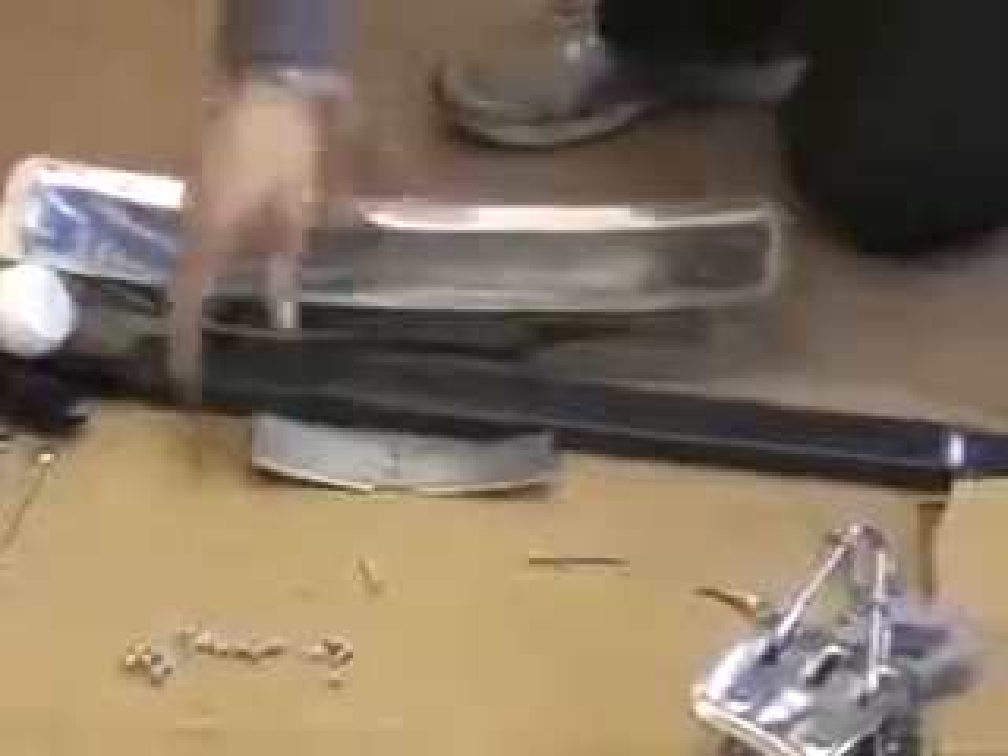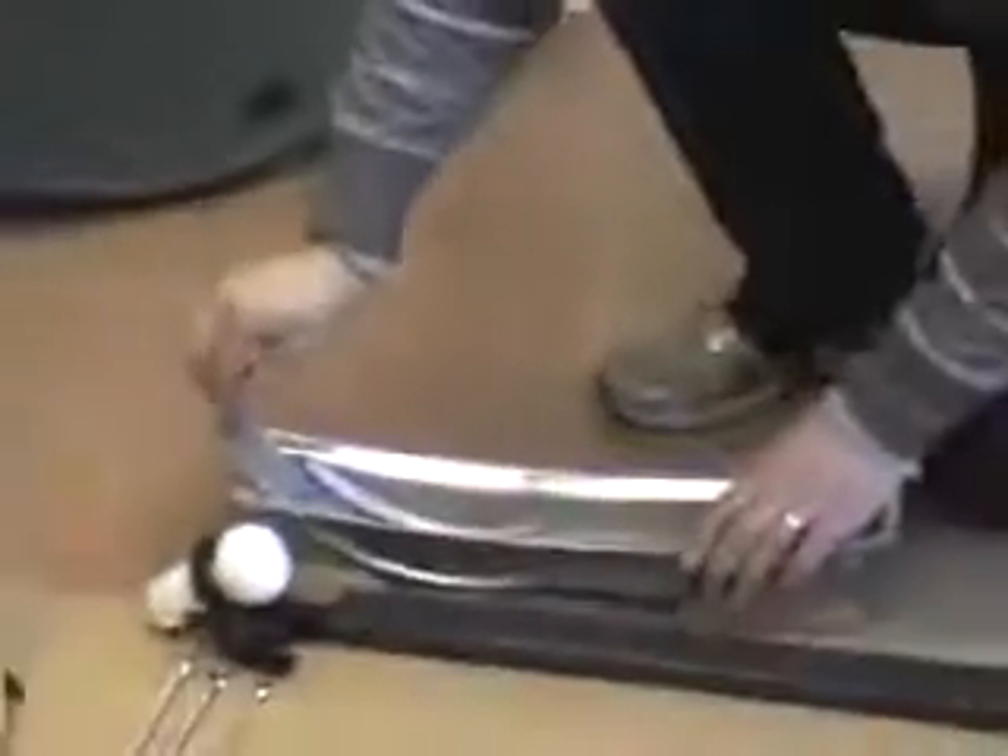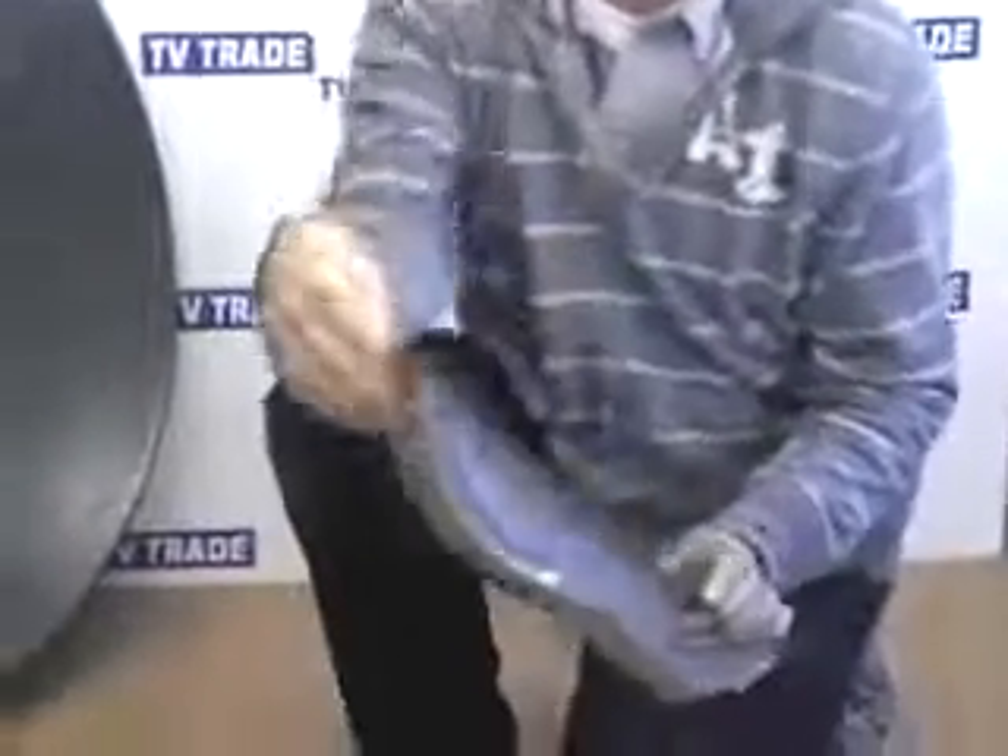The first thing I'm going to do is assemble the very basics. I take this sheet of metal — it's an important part — and you feed it back into the dish bracket. The purpose of this is that when we're tightening the nuts at the pivot point, it will give rigidity so it won't squish under the weight. It will actually lock tight, so we can lock the dish tightly into position.